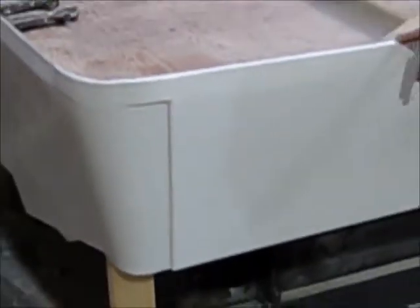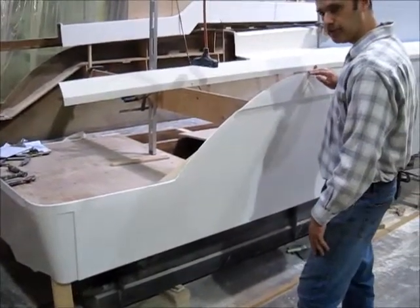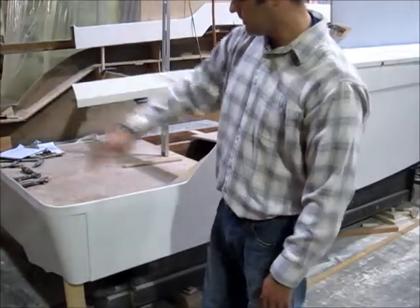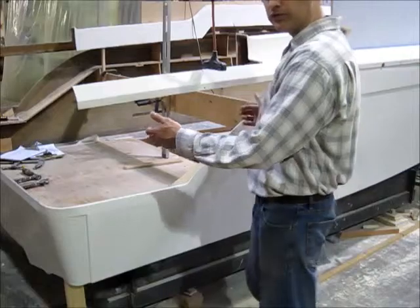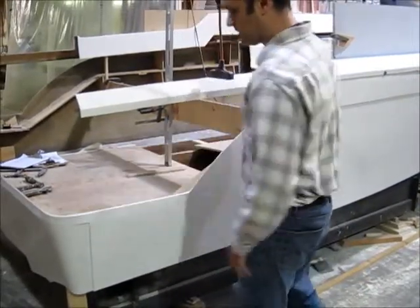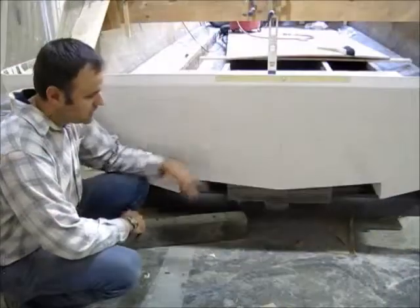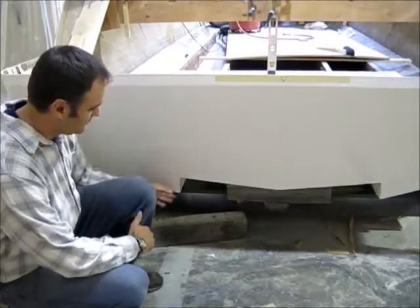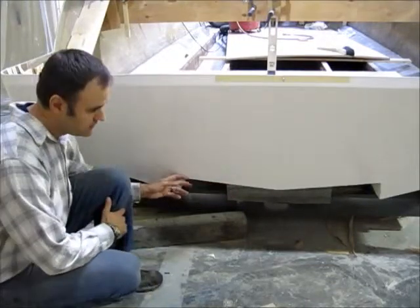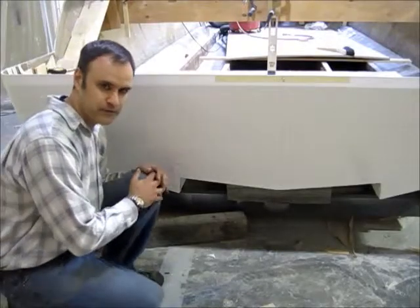You can see this has been cut down in our existing hull — it runs straight through like so. We pulled it out of the mold and then we cut this shape. The swim grid is going to sit here. In the transom area you can see that it's stepped up — we created this in our insert, which was not in our original hull design. It's a performance feature.